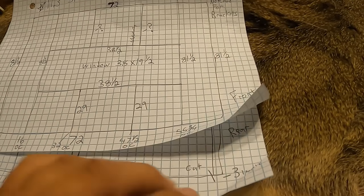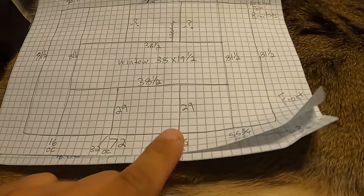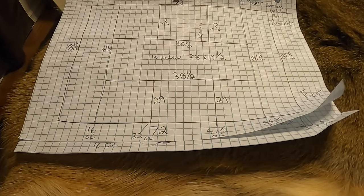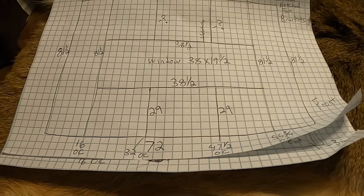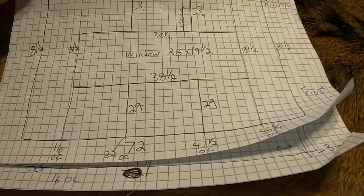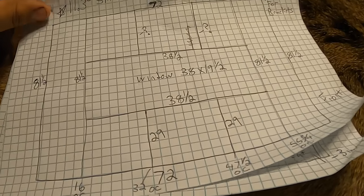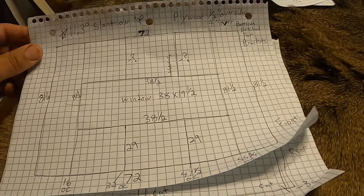And then on the bottoms, even on the sides, I don't remember if I mentioned that, but on the bottom I made the plywood overhang 4 inches, just to overhang the base a little bit, to keep it dry and make it easier for assembly. Because with that overhang, one person can just set it on the base, flip it up, and it kind of stands there by itself, and slap some screws in there.